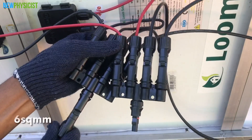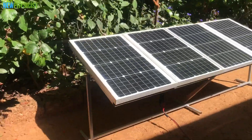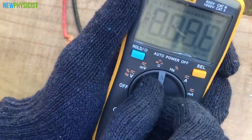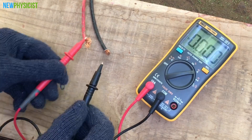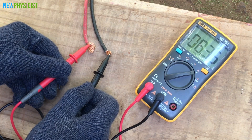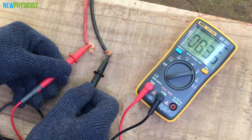You can easily calculate the DC wire gauge using any of the online wire gauge calculators. Let's check the VOC and ISC of the solar array we just connected. Adjust the multimeter to the 10A range and then connect the testing leads to the solar panel output. When we connect our meter to a solar panel we are actually short-circuiting it, which means the maximum current will flow. Here we get an ISC of 8A.